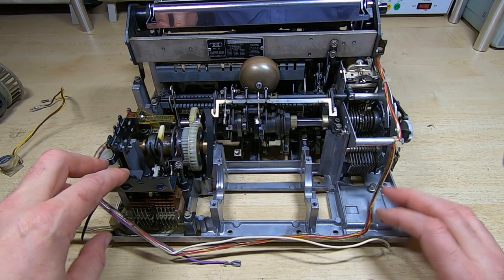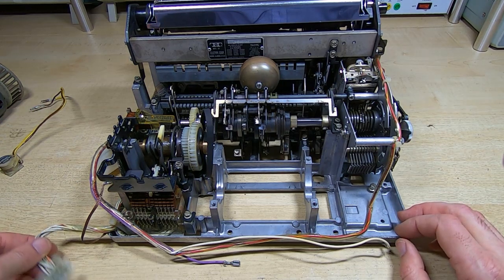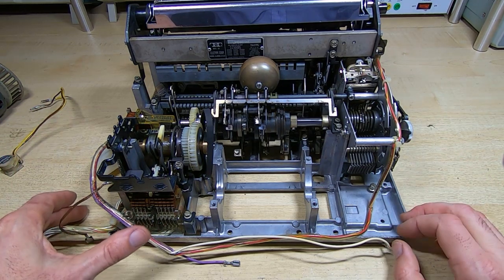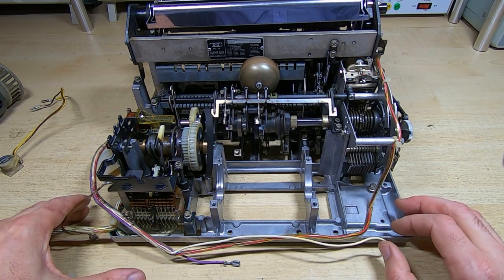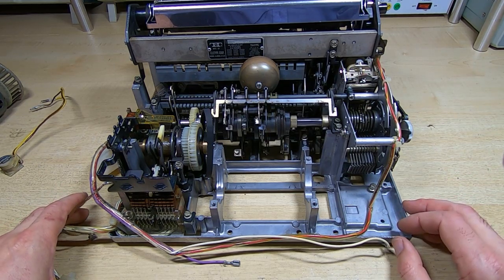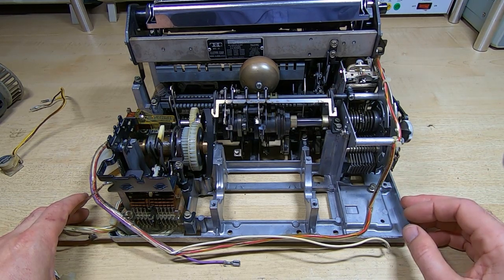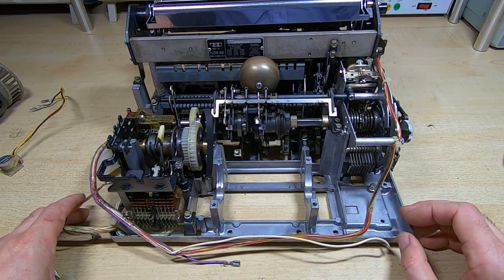And this is one of the issues that people often have. They'll quite rightly be afraid to get things wet, and I strongly advise not to put water on electrical devices unless you really are sure you know exactly what you're doing, and even then make sure you dry it off properly. Something like a transformer, if you get it wet, could take up to a month to dry out. Even if you put it into a fairly high temperature, it will take a very long time to dry.